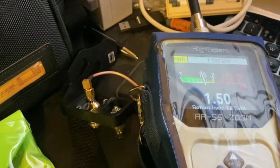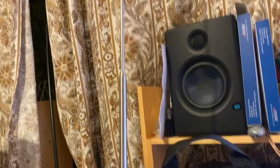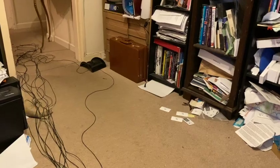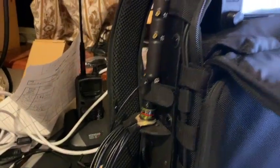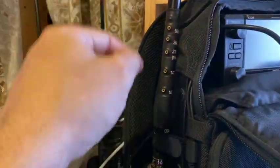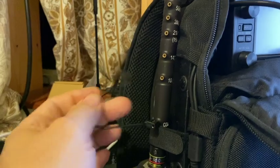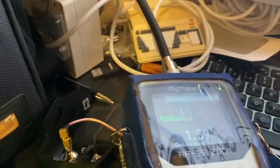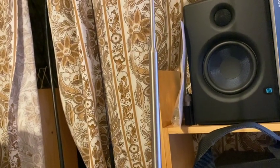Obviously with QRP I want it to be as close to 1:1 as possible. You can see how getting this antenna matched just takes getting your radials out on the ground. In the field you'd be spreading these out nicely so you get plenty of return path and no crossing — I'm sure that's not helping this situation but for the sake of demonstration. So: get your radials out, get the plug in for the right band — with 40 metres I don't need to plug anything in. Get your Rig Expert into repeat mode and then slowly push the antenna up and slowly adjust it as you go.